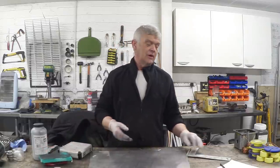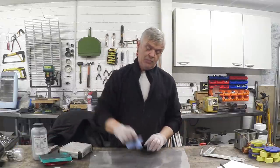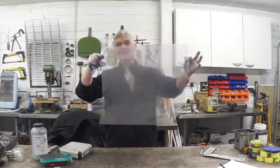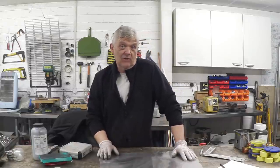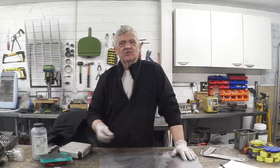You don't have to use sandpaper — lots of things will do it. We've used wool, cotton, sandpapers, and even paper. By rubbing it with paper you set up a difference in electrostatic attraction. The graphene gets stuck to the plastic, the rest comes off on the paper, and you end up with a layer of graphene — an invisible layer laying on top of the plastic. We did lots of videos on this, using it for touch sensors, electricity generation, and heating mats, as well as making large sheets of graphene.